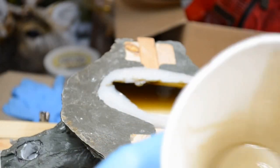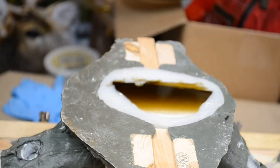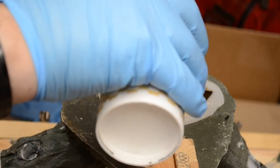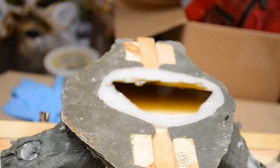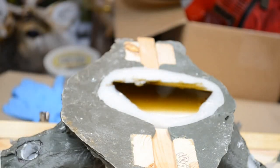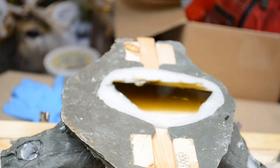And here's what I have left over. I guess I could have used about a half an ounce instead of a full 1 ounce. It looks like there's about a half ounce left in there. But on the casting resin, I'm not overly concerned. Like I say, it's $44 for the quart kit, but that's a far cry from the expense of silicone. And yeah, you could go cheaper if you want in the products. It's starting to set up, but I don't want to go cheap, so I go with what I know works for me. All I can do is recommend it to you, and we go from there.